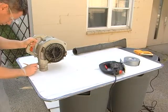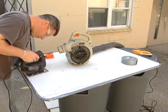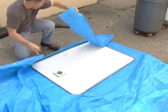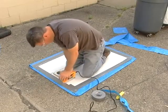Next, you need to cut a hole to mount your leaf blower on top of the hovercraft so that it blows air out towards the bottom. Then lay your hovercraft out over the tarp, overlap the tarp on top of the hovercraft, attach it with plenty of staples and duct tape so you get a nice airtight fit, and then flip your hovercraft over.